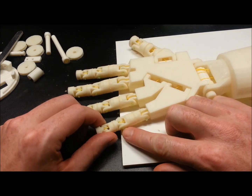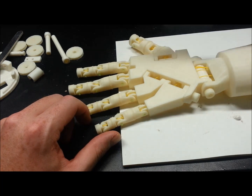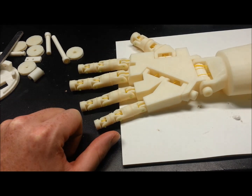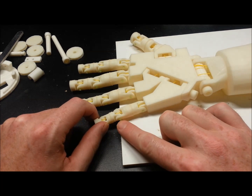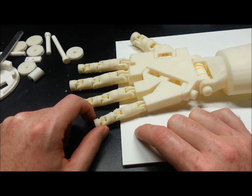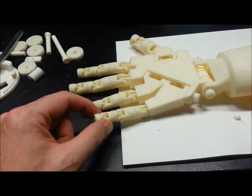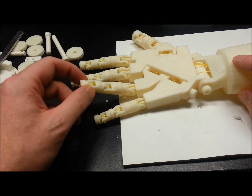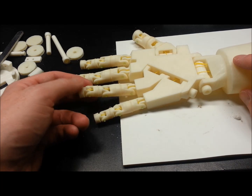What I did: I put them through and then I took my hot air rework gun — which turns on as soon as I take it off the cradle, that's a hot air rework soldering station — and just warmed up the nub and gave it a tap with my side cutters to peen it over. And I'm really happy with this. Very little lateral play in the joints themselves. The print came out good.